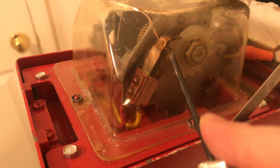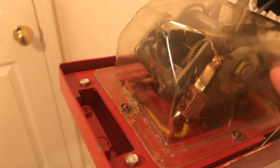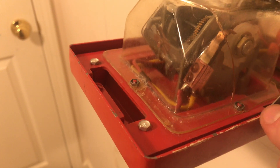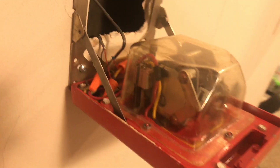The general alarm switch, instead of pulsing out a code, makes the bell run continuous. The reason I'm not concerned about fixing it right now is that this is a single stroke bell, so if you apply continuous power it will just ding once. You can also see the official Underwriter Laboratory certification and the box serial number. Down here is the gear with 2, 4, and 3 — that's the gear that pulses out the box — and this is the switch that runs the power.